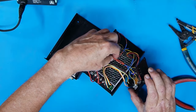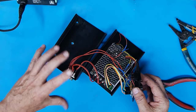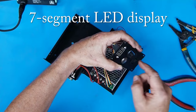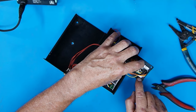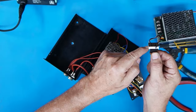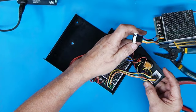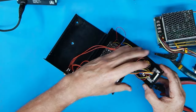All that does is route the power out to the limit switch and back again — I'll put the wiring diagram in the comments below — which will kill the power if the limit switch opens up. The LED — seven-segment display here. I just made this very simple, just hacked this out with a hacksaw. As they come, they have no way to fasten them. So basically I just made a very tight-fitting piece of aluminum to squeeze the sides, then crazy-glued it in place, and then it has two drilled and tapped screw holes. Then I can screw it into the panel to hold it in place — it holds it from the front and this holds it from the back.